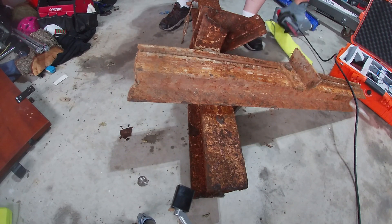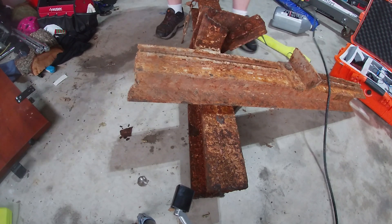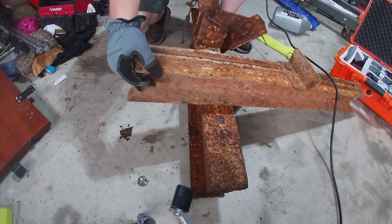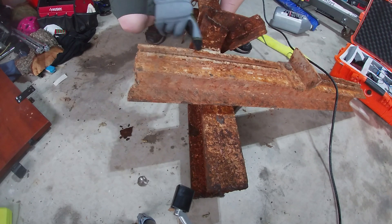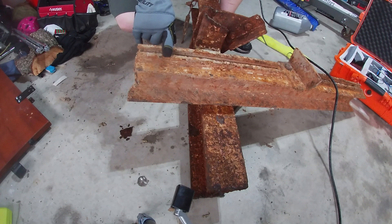So what we're going to try first here is using a reciprocating saw on a four inch I-beam. It's hard to tell in the rust, but that's a galvanized electrical channel on top, which does not come off — it will be covered in all the conduits in the silo, so we have to cut through it.